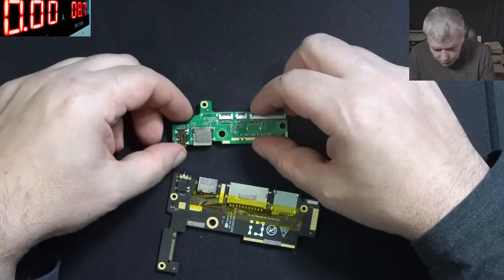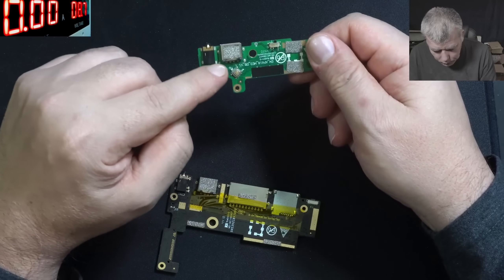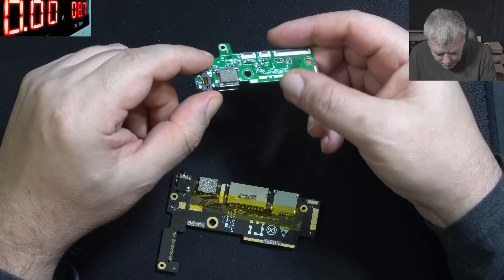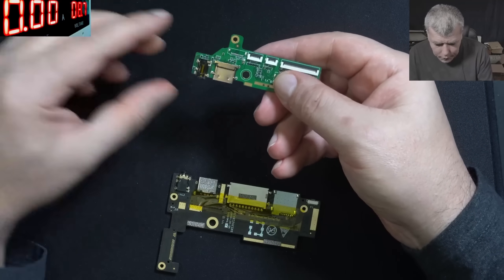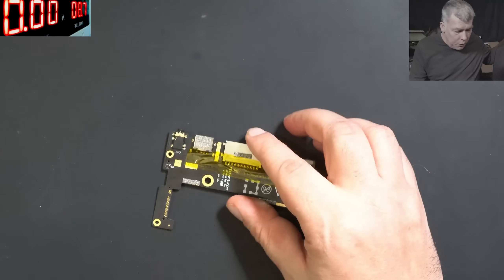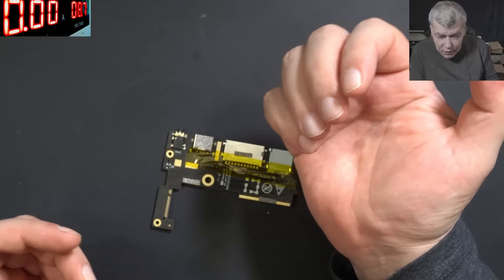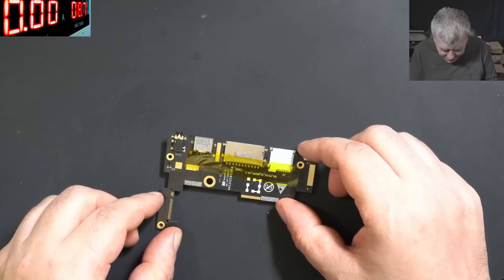The question is how we deal with this kind of repair. If I come with hot air from one side I can melt the plastic parts; if I come from the other side I can melt the headphone jack or the connectors. So the right approach is to try to isolate with Kapton tape — but be careful, because I've heard some people use aluminum foil. The problem is that when heat hits the tape it can start to shrink or move.